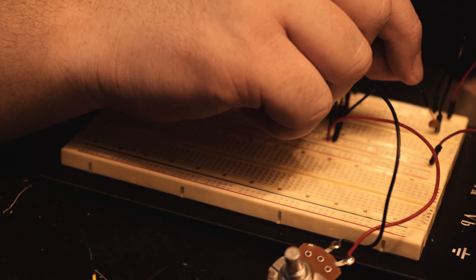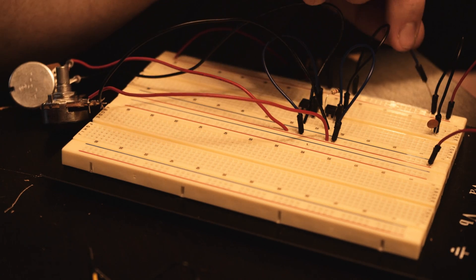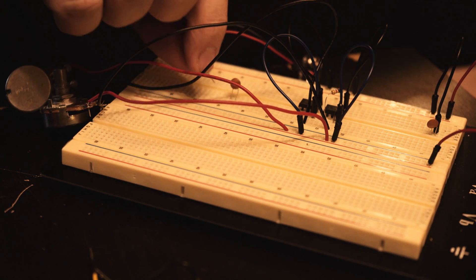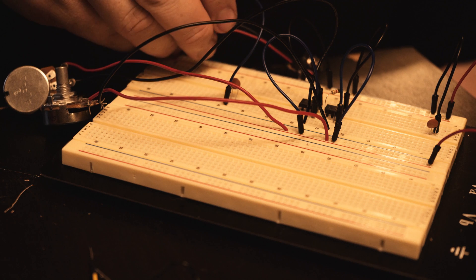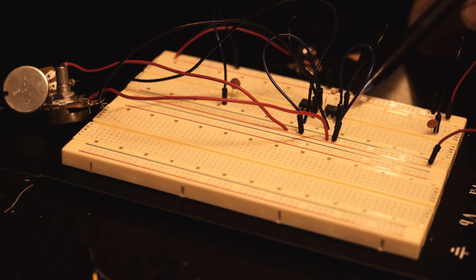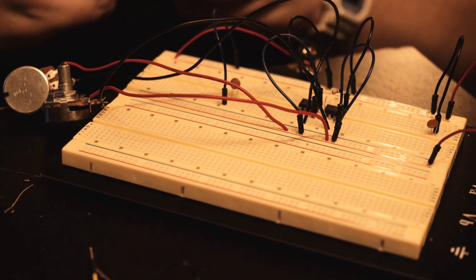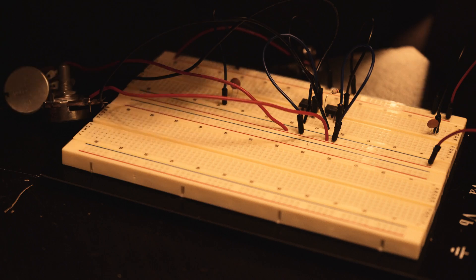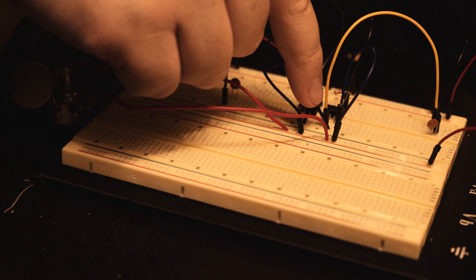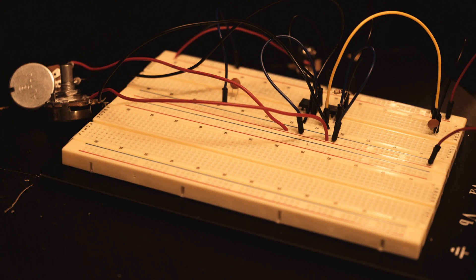I added a cap up here and it's connected to the ground. I'm going to do the same exact thing for the second chip, and that's going to be connected also to the ground. Now this 6th pin, where the resistor jumped from the 7th to the 6th, needs to be connected over to the capacitor. So we'll run from the 6th pin up to the capacitor — this 6th pin is going up to line 5 and being drained out into the ground.